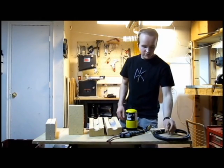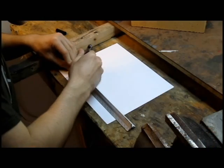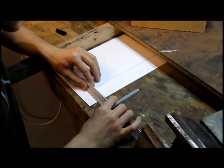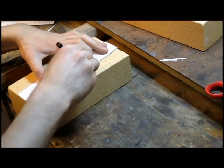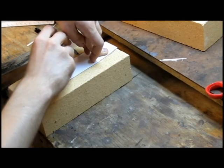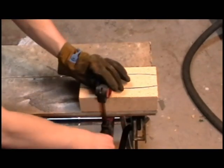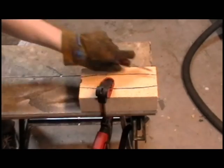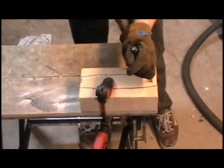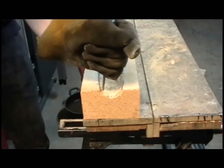This is all the materials you need to build your forge. The template for the inside of the forge starts with a 2 inch by 9 inch red template; it tapers down at the ends a quarter inch on each side to make an overall oval shape. After you cut it out, trace it to the face of the brick — this is the area that you will cut out to make the forge. The next step is to chisel out the cavity. Use safety glasses and a dust mask to protect you, as well as a glove on the hand holding the chisel. Angle the chisel away from your face so that the debris flies away from you. The inside doesn't need to be perfect, but try to give it a smooth contour that is as close to a half circle in profile as possible.